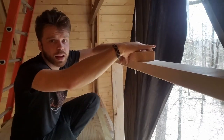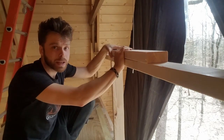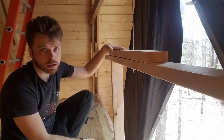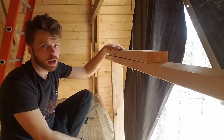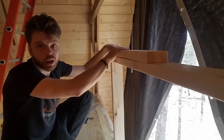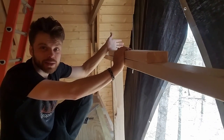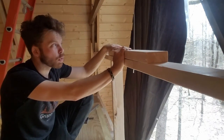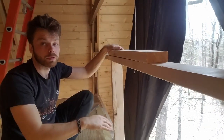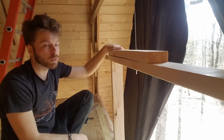If you looked at the video for the bottom part, these beams I was laying them up two 2x4 thick plus a half inch sheet of OSB. Two reasons: one of them is to make them stronger so they're basically doubled up headers. They're not load bearing in the sense of carrying walls or anything, but it's more than just holding up a single window since there's multiple windows on top of each other. I want it to be nice and sturdy.